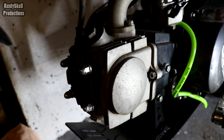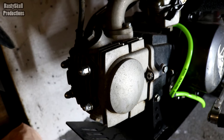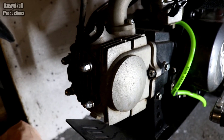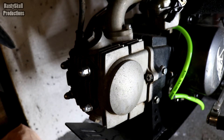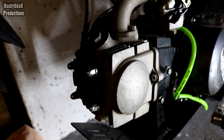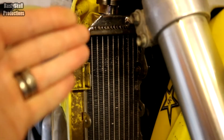The disadvantage of an air-cooled engine is you can't really have the engine itself in a closed environment because there's no way air is going to get through — you're going to need a fan blowing on the engine. That's what lawnmowers and generators have: a fan built into the flywheel that blows air on the engine. That's how air-cooled generators and lawnmowers stay cool enough while running in one place.